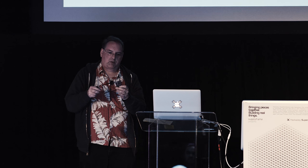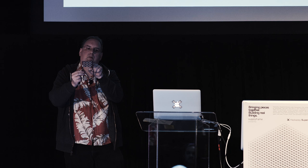This was the first time I panelized a board, and I made a terrible mistake. My tabs here, to make a long story short, are too strong. I didn't make them weak enough so that they could break easily, so I have to Dremel all these boards apart. So that's something to learn from.